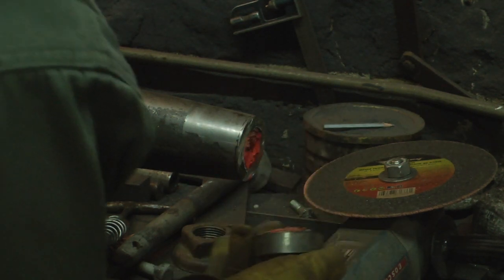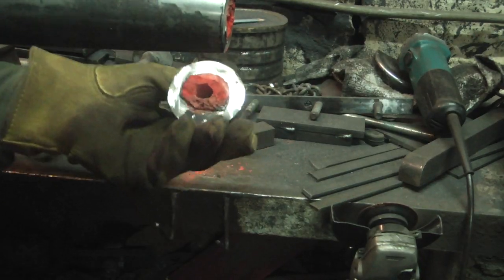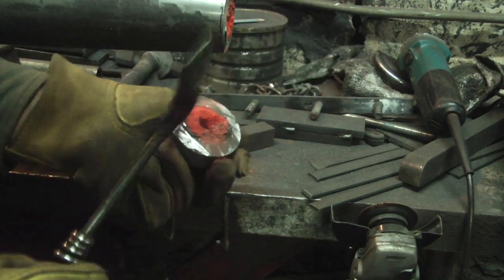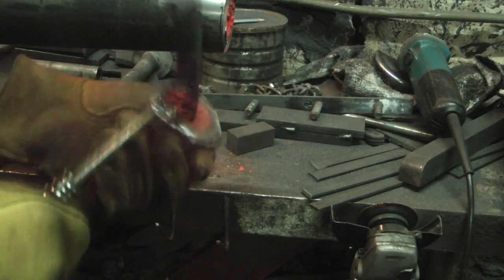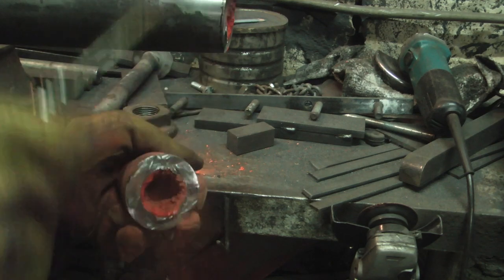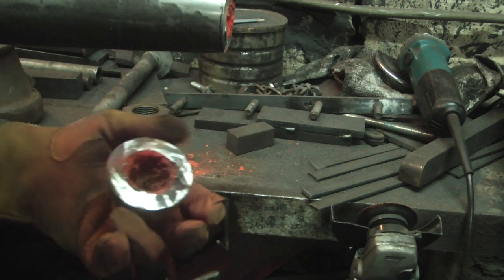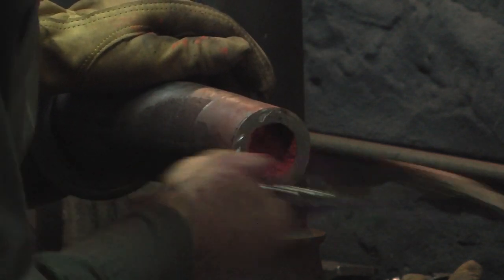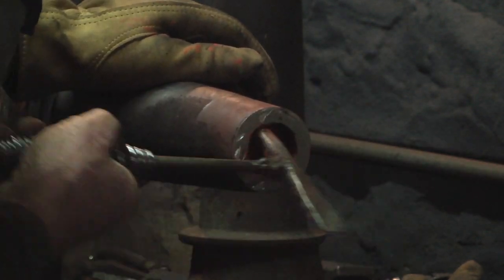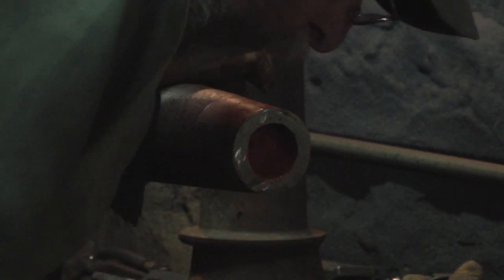Now I've replaced quite a number of these skeins on wood axles, and most of them have a little void between the end of the wood axle and where the threads are. This skein, however, was pressed on with some type of a compound, I don't know just what it was, that completely filled all the cavity and actually helped adhere the skein onto the wood axle. So trying to get this skein off of the axle would have almost been virtually impossible, short of perhaps burning it off. And finally, at about an inch in, I finally found the wood axle itself.